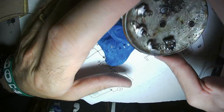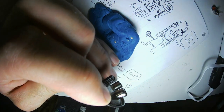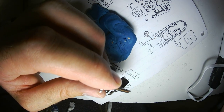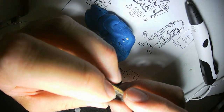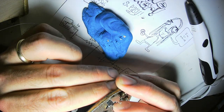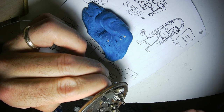If you've watched the other videos on my channel, you will know that when I have an oscillator or a filter connected to my bench power supply, it does this thing where the oscillator will go off, because the power supply is super janky. It's two external hard drive style power supplies that had positive 12, positive 5, and ground. Cheapest possible power supplies you could possibly think of that could do that kind of watts at least.